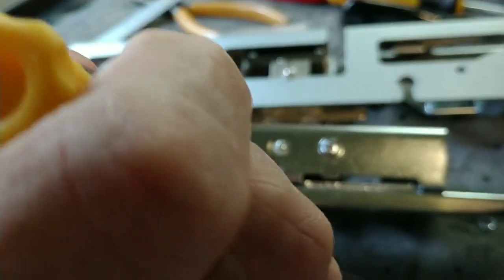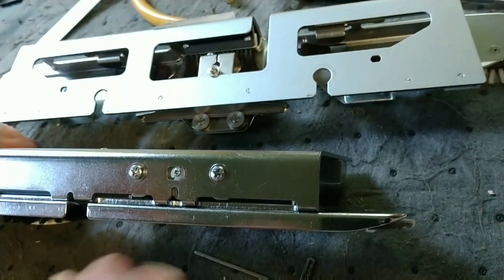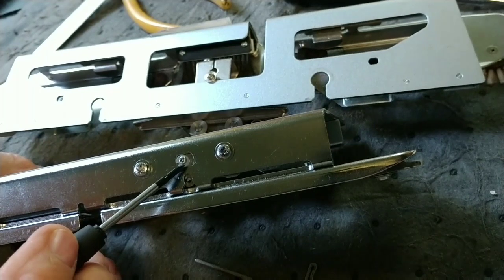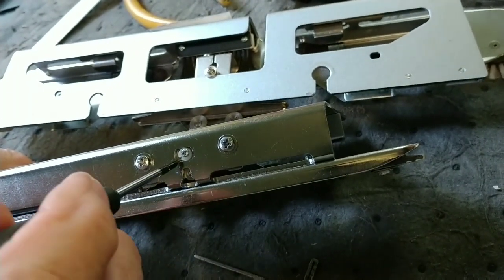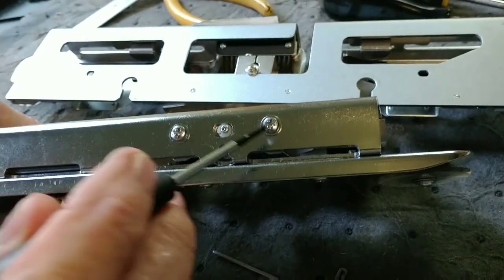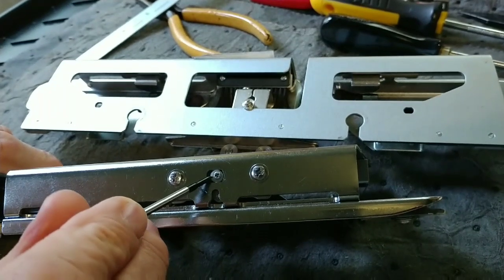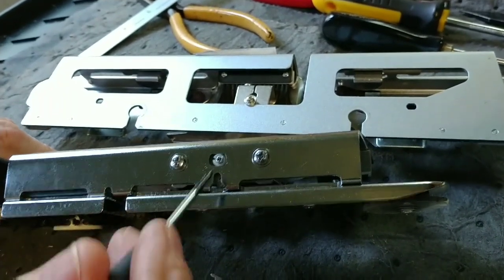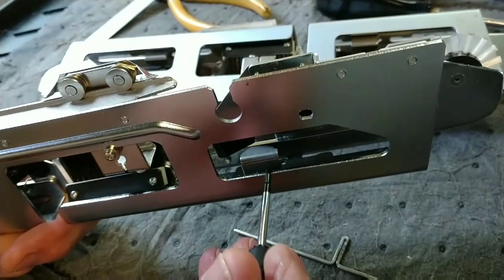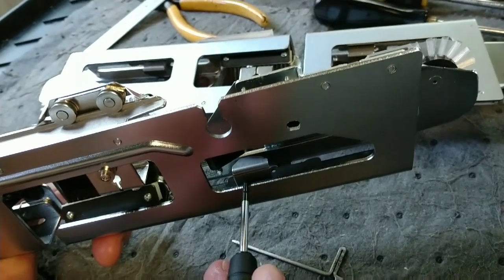If you loosen these two screws right here — I've already loosened them, so now they're really loose. You'll notice it moves back and forth, so that's a placement. But this white piece right here is a cam. I'm going to move it so you can see there's a slot — it'll go up and down because of that. So you loosen these two screws and then you loosen this center screw. If we move this cam around like I'm doing there, it changes the critical height of the piece that we're looking at. So we have a working carriage, and you're going to base your adjustment on this non-working one on what is working.